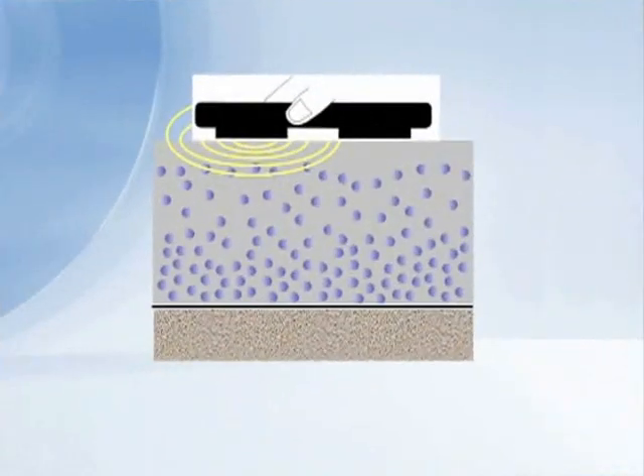So these meters are tuned so that the fields don't penetrate deep into the concrete where the steel is located. Therefore, they're only measuring what's going on close to the surface. And as you see in this slide, you have no sense of the fact that four or five inches down in the concrete, it may be very wet.